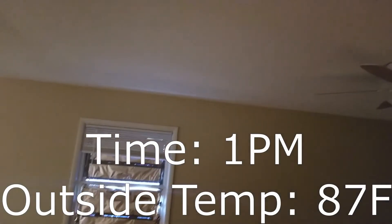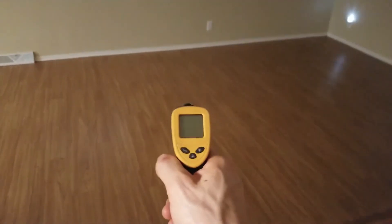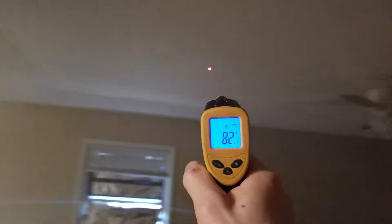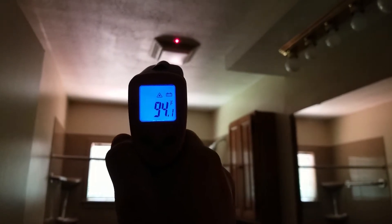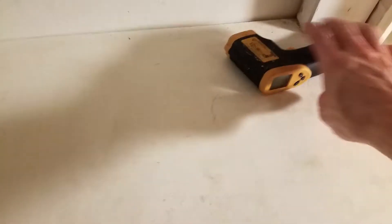It could just be because the strip is directly above this area. This is an update after applying paint to one half of the roof on this side, and a tiny bit on the other side — probably about a fifth of the roof total — and then I ran out of paint. The interior is at 79 degrees. Let's see if this vent is still 100 degrees: there's a very big difference here. It's peaking about 95, and it was about 102 last time.